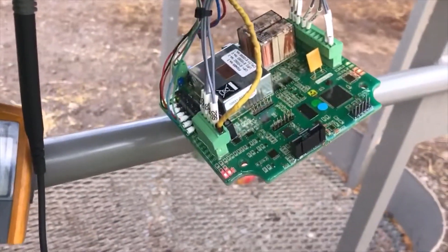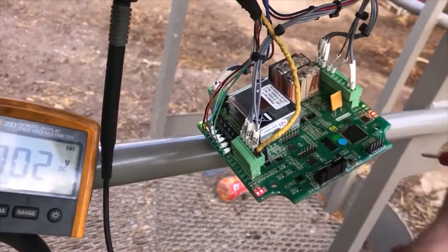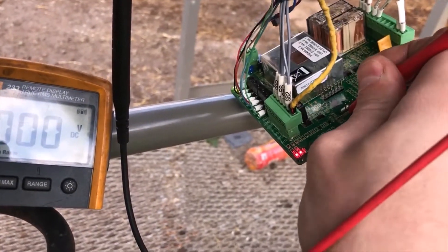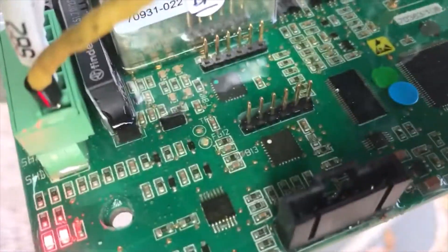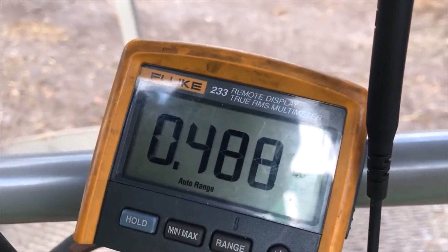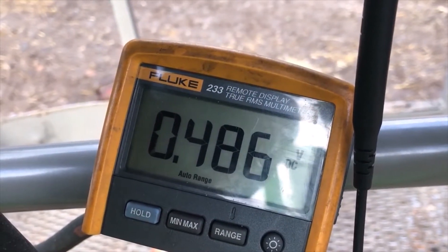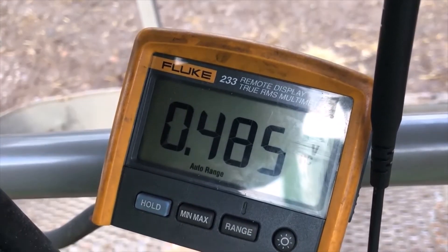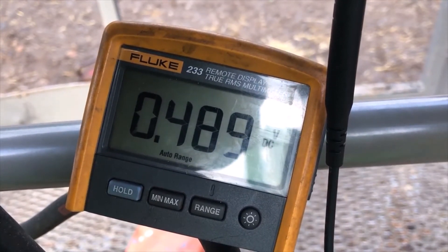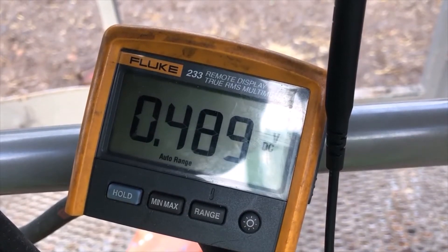So I put this new board on for the trial - the old one is still there and I put this new one on just to make sure. If I look on the screen I have 0% of the cage weight and it's not going into overload. If I measure the voltage on the test point here, this is test point 1 and this is test point 2. So if I measure test point 1, now I have 480 millivolts. And if I go on the next test point, I have 489 to 490 millivolts. So it's about half a volt.